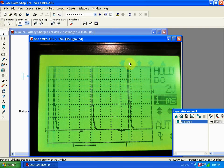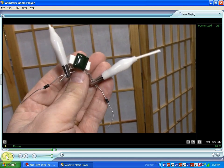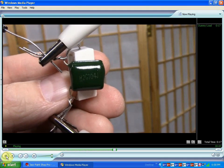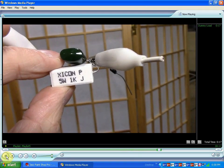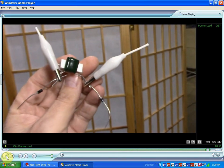I also used a 10x reduction probe, so this is over a hundred volts. And thanks to the capacitor I have a little bit of a foot so I can see the voltage spike clearly. Here's a canned shot of that dummy load, taking the place of the batteries to be charged. I'll use this for my testing so I can tell what's happening — you can't measure a voltage spike across a battery.